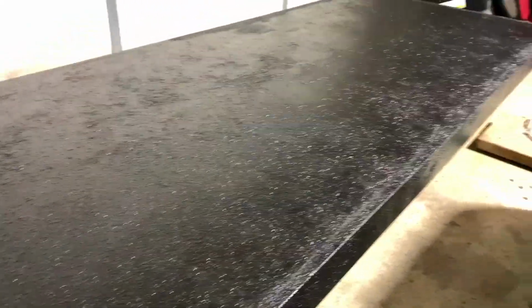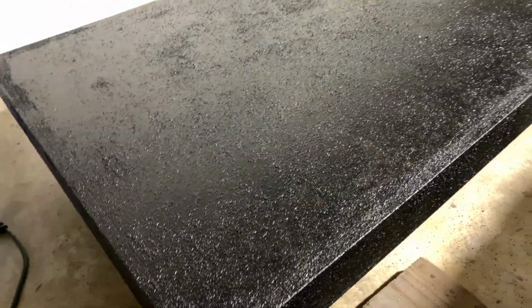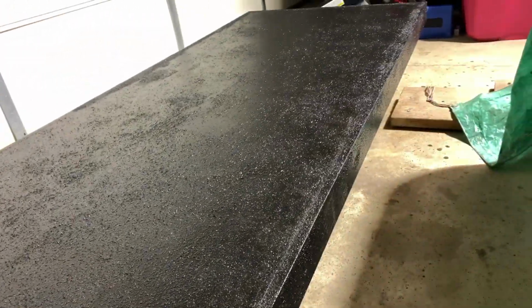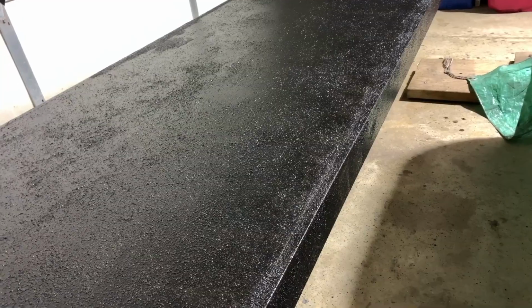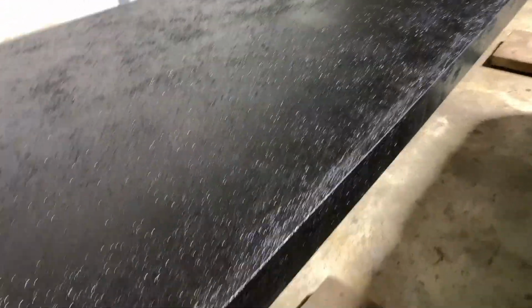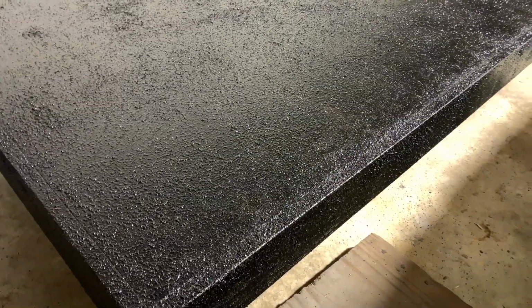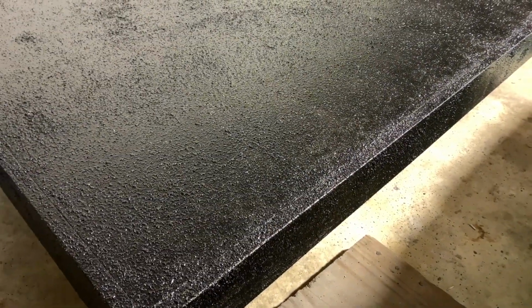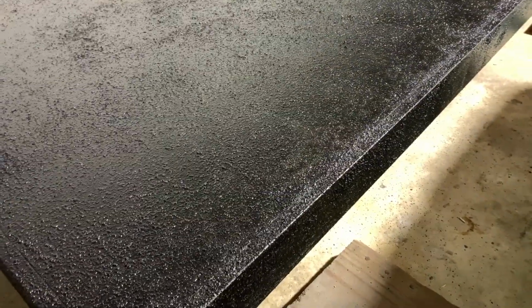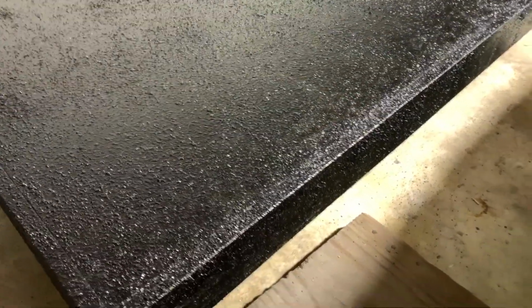So again though, pretty impressed with it for a first coat at how well it covered everything, and really feeling good about how waterproof this thing is going to be when I put the second coat on. So it should essentially be like a rubber box on the outside. And then on the inside, I am going to spar urethane literally everything that doesn't have the Herculiner on it. I'm just going to be super safe for condensation, for if water happened to get in the tent. I just really don't want the box to ever rot.